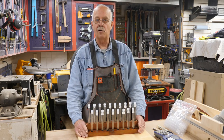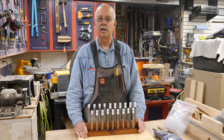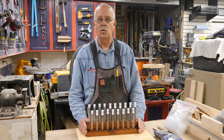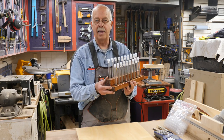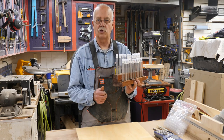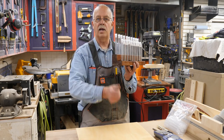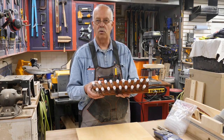What I did was I ran it through the planer — you can do the same thing on your table saw — and I cut it down so it was three inches square, originally three and a half but it was severely weathered. Then I set the blade up one and a half inches, set my fence one and a half inches, made two cuts — one this way, one this way — to make an L shape.